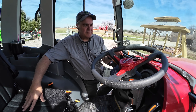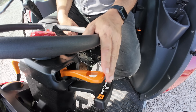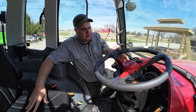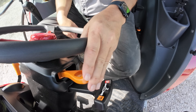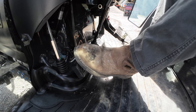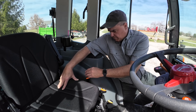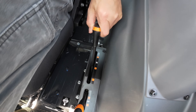We'll start here at the left-hand side of the operator. This is a forward-reverse lever — basically a shuttle shift, but I'll say a little more about calling it a shuttle transmission in a minute. Forward, neutral, and reverse right here; you can reach it with your thumb up on the steering wheel or your fingers on the steering and reach down to do the shifting. Down here to the left we have a clutch — I've yet to find a purpose for it. The main lever relevant to our discussion today is the three-speed range lever: one, two, and three. Much like most hydrostatic tractors, we have three ranges.